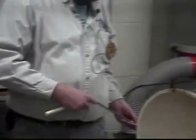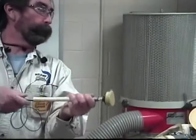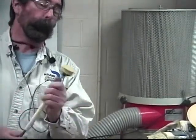When it comes to sanding, after what I spend my most money on, my turning tools, I would say sanding is second for where I invest money. And this thing, I know somebody must have picked it up, but this is just an extension. Put it on a drill, and then put your sanding disc on down here. It's for getting into vessels and stuff, getting down inside. A simple way, if you're using an extension, take a little piece of PVC, slide it over the shaft, and then as you're running, you hang onto the PVC. It's just a nice way of having a handle, and it gives you a lot more control with sanding.